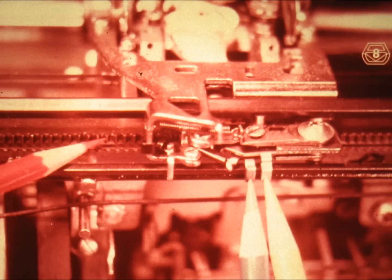When we wanted to use some of the positive power, we utilized ratchet and spring clutches, which we studied in programs 10-1A and 10-1B. When we want to use some of the negative power stored in the mainspring, we utilize the escapement, which is really a modified ratchet clutch. The pawl for this ratchet clutch, indicated by the blue pencil, is called the escapement pawl, and it engages with the escapement rack indicated by the red pencil. This is a picture of a partially disassembled machine — you should take some time to locate the escapement pawl and rack on your machine. It is easy to see the engagement between the two when you tilt your machine so it stands on its back, then position the carrier sideways to view it from below.